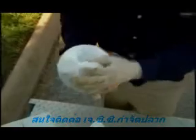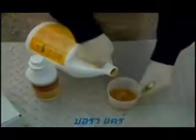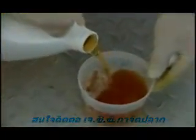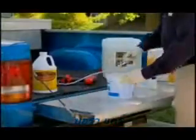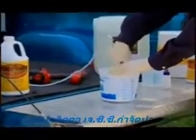To create a foaming solution, add the correct amount of Pro-Foam Platinum to the mixture. This is determined by the application, the label guidelines, and the type of equipment you are using. A generally suggested foam ratio to use for wall and gallery applications is 20 to 25 parts foam to 1 part liquid solution.